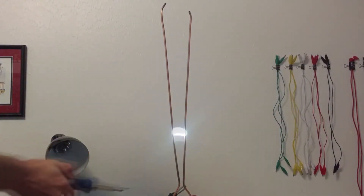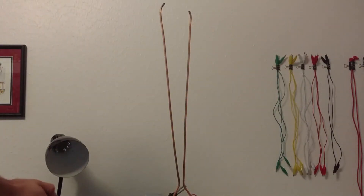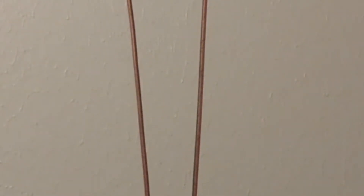Now the reason it rises — like with the Jacob's Ladder, it gives that effect — is because plasma is very hot. It's superheated air, and hot air rises, as we know. So the plasma begins to rise, and because it still has a very low resistance and is easy for the electricity to flow through, the electricity just kind of follows it all the way up, until it disperses so much that it can't go through anymore. So that's a rough explanation of how they work — but it's mostly just magic, to be honest.